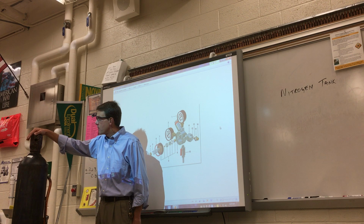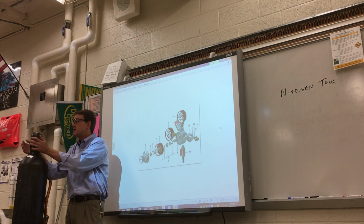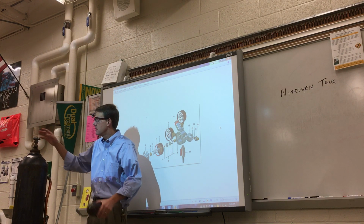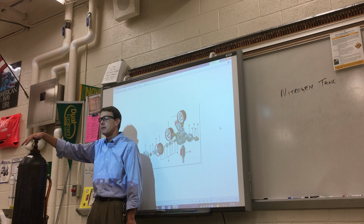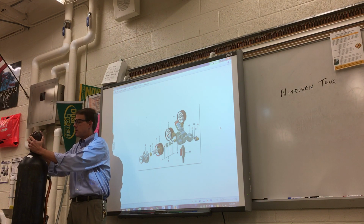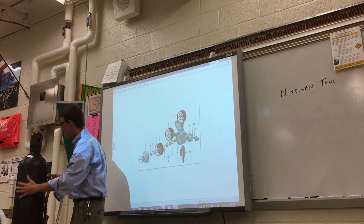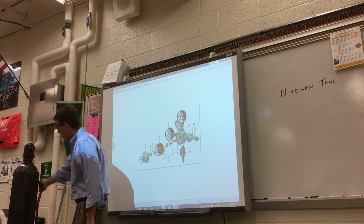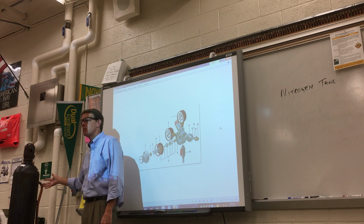Underneath this cap, whenever we move it around, got to have the cap on, because underneath this cap is the main tank valve. So once you move it to the location that you need it in, then you can take the cap off and start with the procedure of putting on the regulator. But not until you get it to the location. And I like to try and keep it, if you notice, it's back up against between a couple pieces of furniture because I just don't want to get knocked over. I like to try and keep it up as close to the wall as possible. Now if it's in a room without the cart, then it's got to be strapped to the wall with a chain.